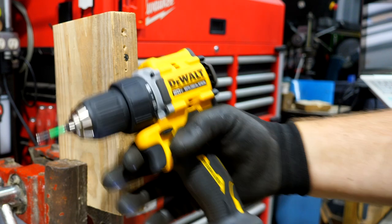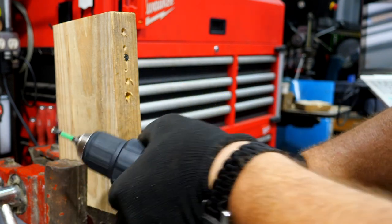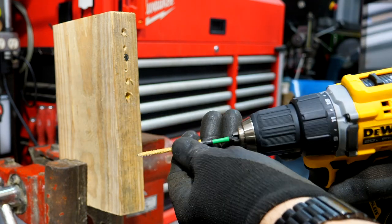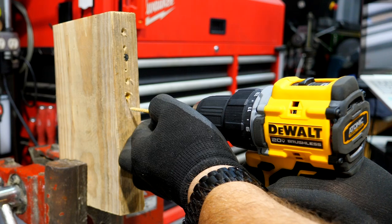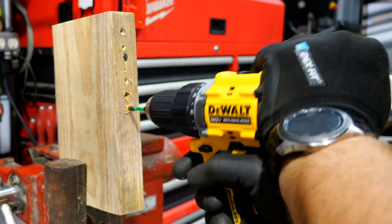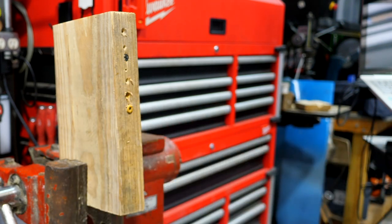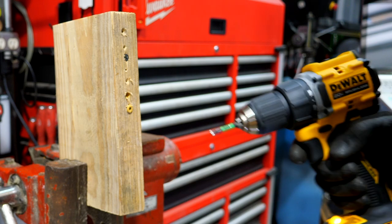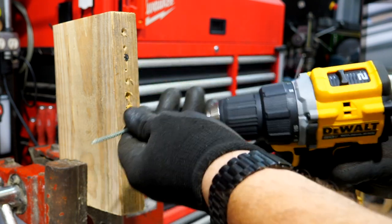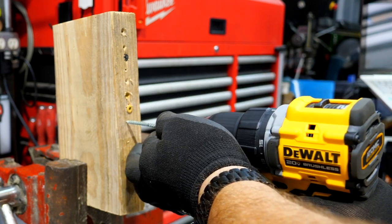Yeah, so there we're actually driving it below surface. Let's see if a more efficient screw, going to back that off to 14. And a better fastening screw here. Yeah, so again, back down to 14, and we're back to kind of a flush. So again, driving this below surface is going to take you locking that out into drill mode. And now I'm going to go to a 4 inch or 3.5 inch fastener.